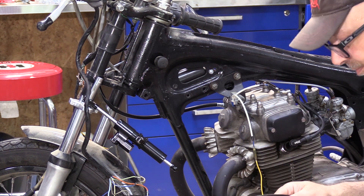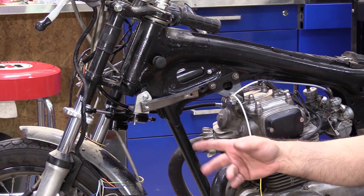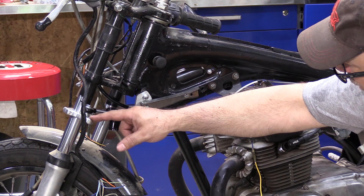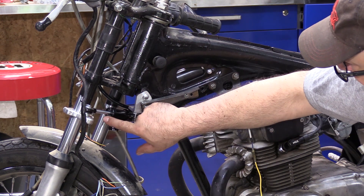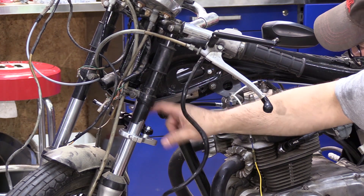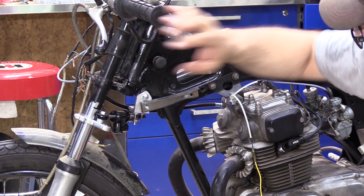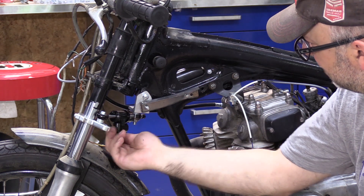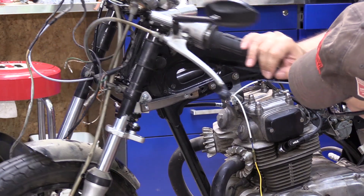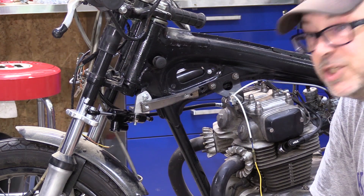Finally, success — I'm happy with this now. I had to drill one more hole so this comes back a little bit, which fixes my alignment. I also lowered this bracket and added some washers underneath it to make sure the body doesn't hit the bracket. Now I have full travel — plenty of extra travel on the steering damper. I haven't got all the bolts completely tight but let's crank that up so we actually feel something. There's a little bit of flex from the bolts not being tight but not very much. I tighten this bolt up and that's going to be fine — I think we can call that one done.